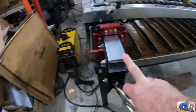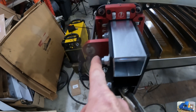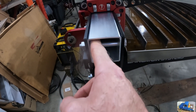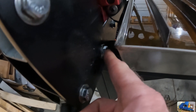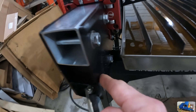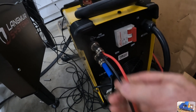One major screw-up - and ironically it was only on this corner - you can't get the bolts out on this side. We put this inner stanchion plate on with the holes on the bottom and they're supposed to be up here to reach in and tighten the bearing block. Luckily we were able to remove this bolt and get our small ratchet wrench in there to tighten it from this end. We screwed up and put the bolts down there, and we couldn't flip the plate because this bolt was trapped by the pan. We just left it - if we really wanted we could have punched two more holes, but since we could get in there and tighten it from this end with the little ratchet wrench, we're good to go.